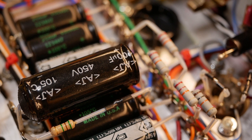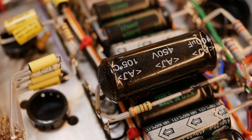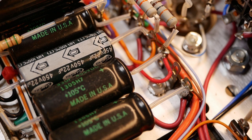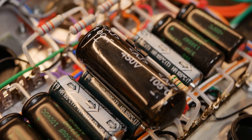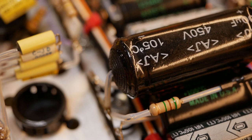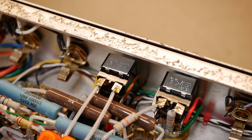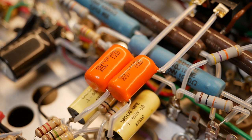So the first suspects are obviously these caps. Talking to my colleagues all over the planet — the caps that have two crimps in them, even though they're polarized, normally you've just got a crimp on one edge, but this one's got one on both sides. I can't remember the brand — 'AJ' or whatever that means — but apparently these all fail. You can see how bulgy this one is; these things look bulgy when they're new, but that looks bulgier than bulgy. That's my first place I'm going to look.